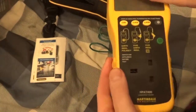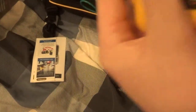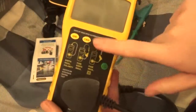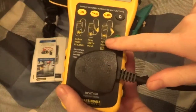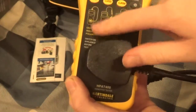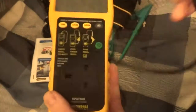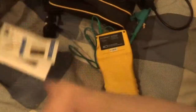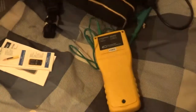It has no batteries in at the moment, so we need to remove the cover. It's got a protective layer on the screen which needs to come off. You've got your plug for putting in the device you wish to PAT test, and you tell it whether it's a class one appliance or class two — class one has an earth, class two is double insulated. The lead is for testing extension leads. Let's have a look at the instruction manual. I have been doing PAT testing in college, so I do have an idea of what I'm doing.